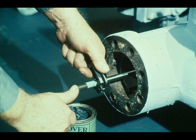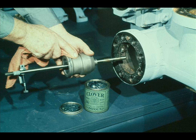Then he positions the valve against the seat and exerts light pressure. To lap the seats, he turns the valve in the seat, maintaining the pressure. Once the lapping is complete, the valve should be removed and cleaned thoroughly with a cleaning solution.